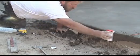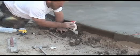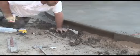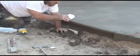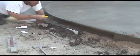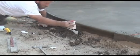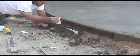The foam profile tools available from Stegmeier are a disposable tool used to finish the face of steps and cantilever edges. This tool is unique because it is made of the actual foam product, making it a perfect fit. Also being made of foam, this tool is flexible and doesn't leave any chatter marks. To use the tool, simply spray water onto the concrete and the tool and rub back and forth.